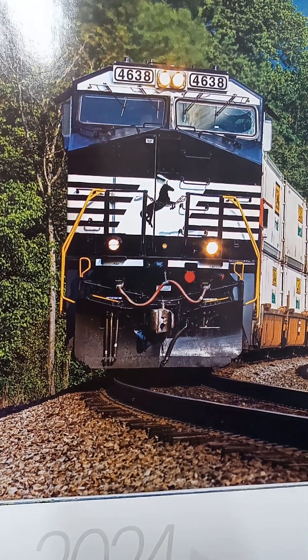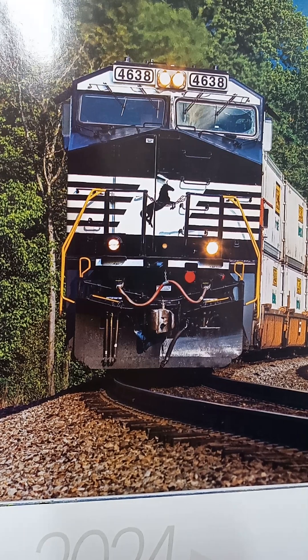That is the cover for a 27-pin train line MU receptacle, and the reason it's red is we advised them to paint it red instead of yellow or something else, because red means hot — electrically hot. There are 27 wires and 27 pins back there behind that lid.